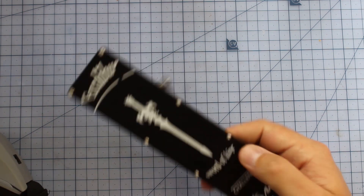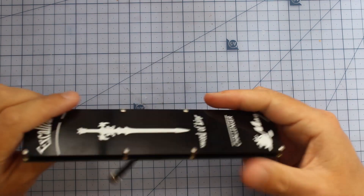This patch right here is my patch of choice — the triple feed patch. I'll link it down below. Trev, Cal and myself all use one of these. The reason you use a patch antenna is because wherever you focus the beam you get really good reception in that area, but when you fly out of that arc your reception might jump over to the omni. So a patch gets really good reception but only in a focused line or area.